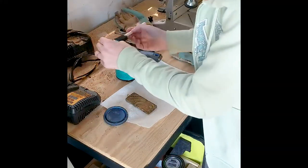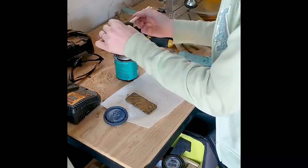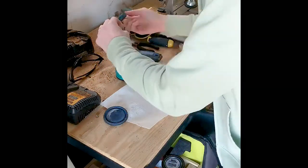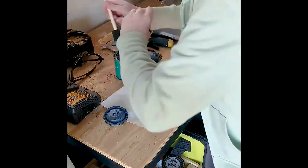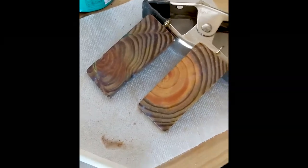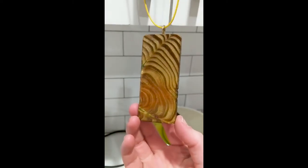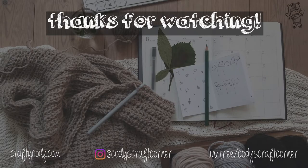I got the eye hooks on there, and then I'm using polycrylic to seal them and add some sheen. I'm just dunking each piece in my little tin of polycrylic and brushing off the excess with a foam brush. I put two coats on, sanding in between coats, and you end up with a really nice protective sheen. It goes on milky but dries crystal clear — and here it is all done. You can see that shine; I might add another coat, but otherwise these are ready to go.